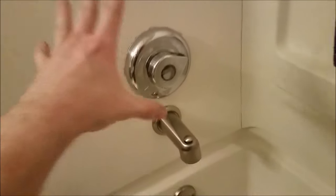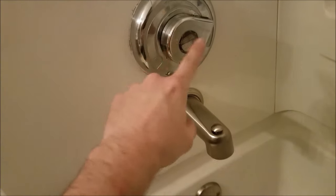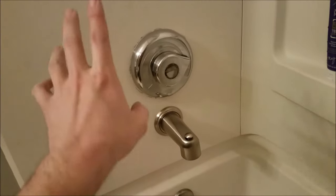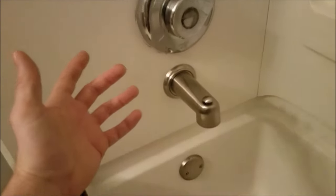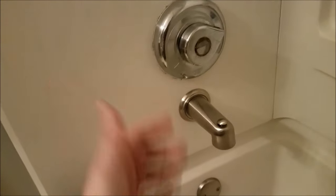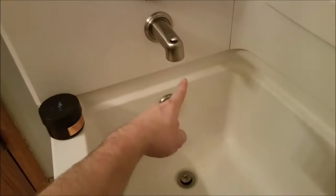Wonder if she'll notice if I threw that away. Anyways, there's the finalized product. This trim kit I will have to attack another day — this is actually a Sterling valve behind here, so it's a 3/8" square notch on there and the trim kits are very specific to that. So I may replace the valve, or I have one of the common Danco style nickel-plated ones that match — I may be able to cobble something up. But for the meantime it is what it is. Looks much better. Thanks for watching.